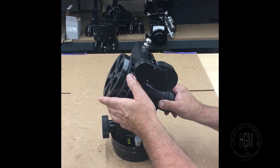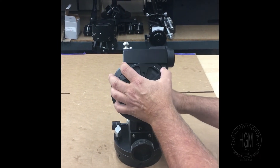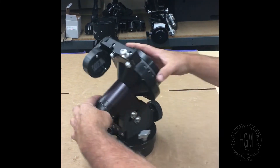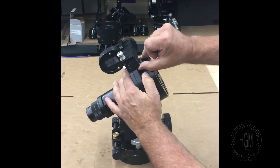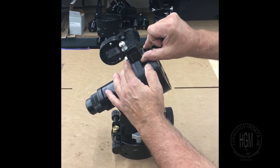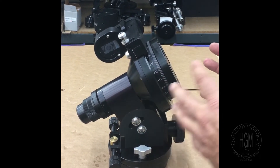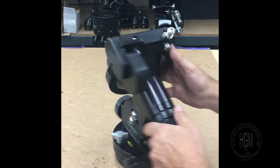What we're going to show you here today is how the spring-loaded worm works and how to adjust it. What we have here is it floats up and down. This is to compensate for any out of concentricity of the main gear or heat changing from the system.